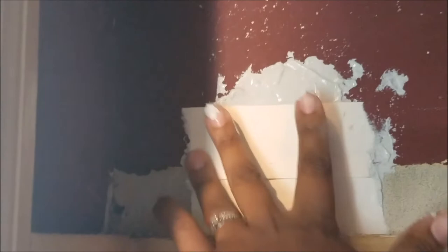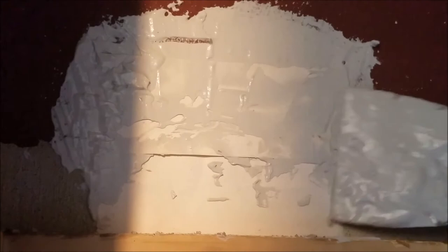I'm using strips of tape, doing the same thing I did on the last hole. I don't mind getting my hands dirty — sometimes it's easier, especially in a tight space, to just get in there. After I put the tape on, I'm skimming a nice thin layer of joint compound over it. This will be my surface to sand down and smooth. It's not going to be exactly like the textured plaster wall, but it looks better than those nasty holes.